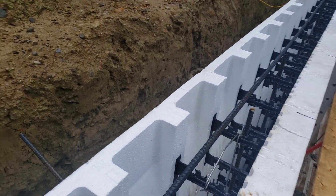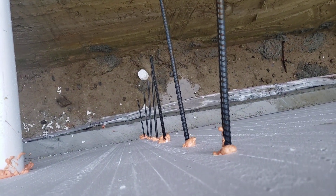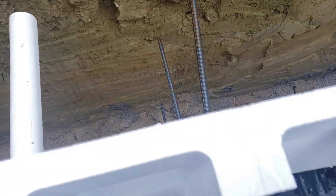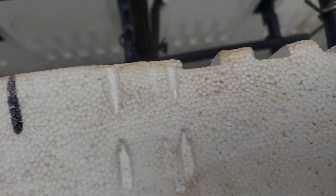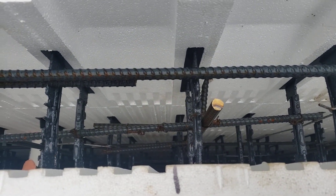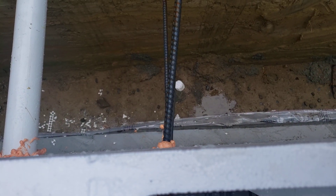Here's another detail. We have a whole series of reinforcing bars that run down the wall. You can see how it comes in there, and then it gets tied to a bar that goes across here — that's about 18 inches. You notice that they're all perfectly aligned there.